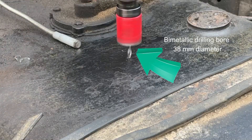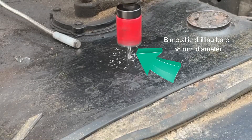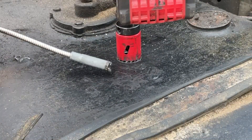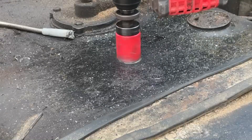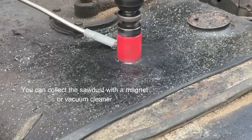The sensor is installed in the center of the tank. If that's not possible, install it as close to the middle as you can, between the front and rear wall. Deviations of the sensor left and right from the longitudinal center axis of the tank do not affect the data quality as much as deviations forward and backward.